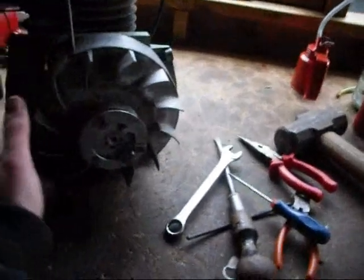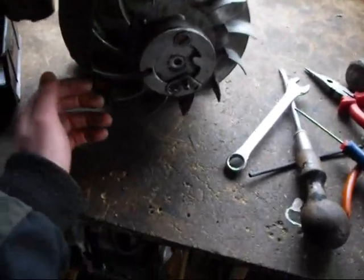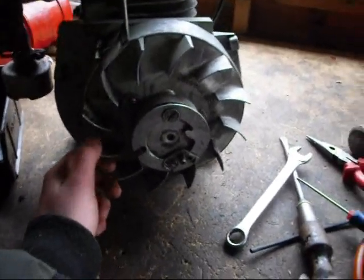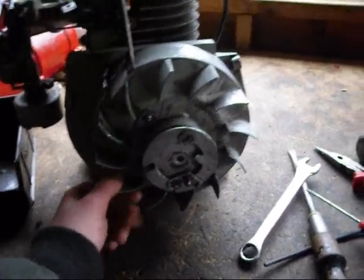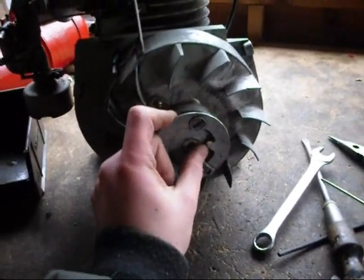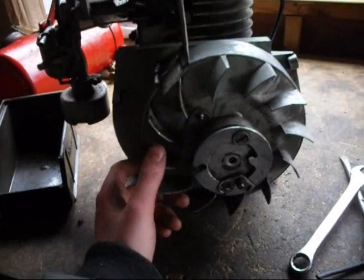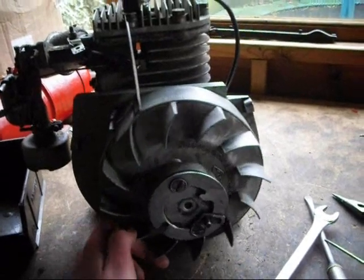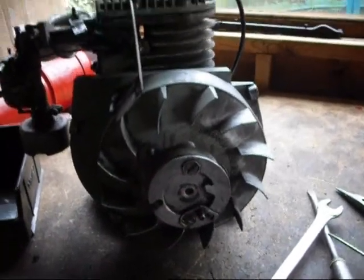Remember to tighten these it's anti-clockwise. The thing you should always do when you put this on is make sure there's no oil on the shaft - in this case there was, so I spent a while cleaning that. White spirit is superb to get rid of it. The shaft is keyed but it's just an extra safety precaution. I tighten the nut up as much as I can with the ratchet, then give it a tap with a hammer and it really won't come undone. But don't overdo it - they're not that strong. These need to be quite tight; again they were loose, another year's running and it might have come off.